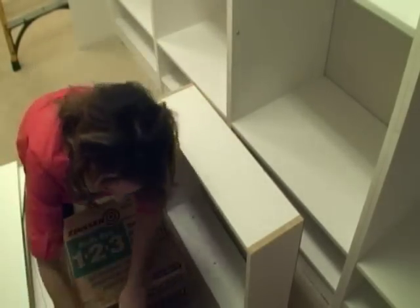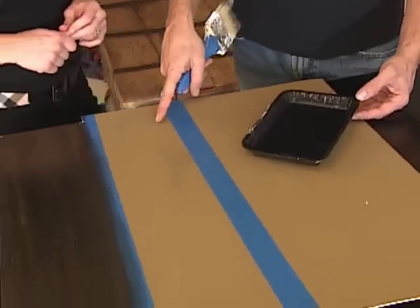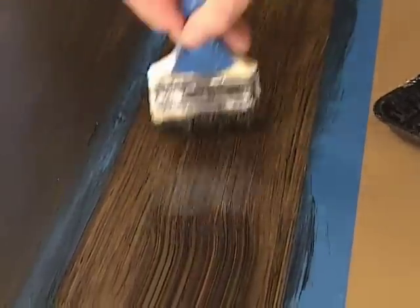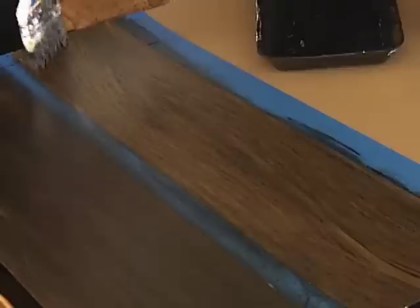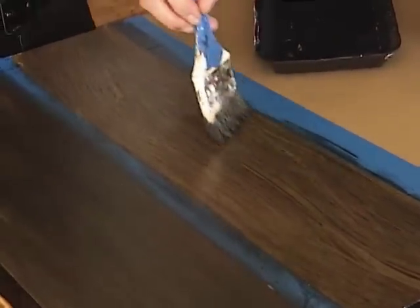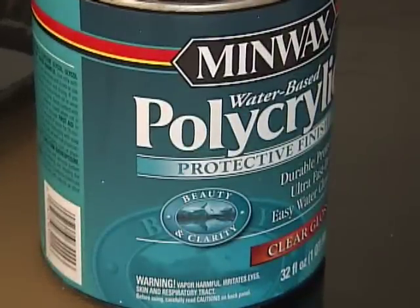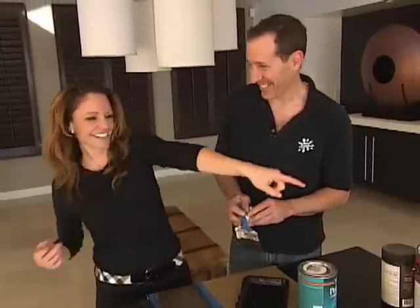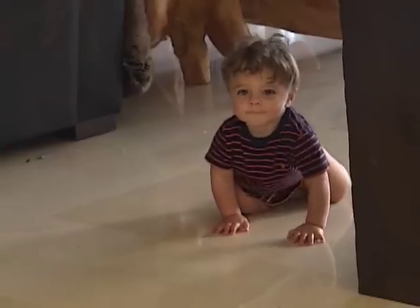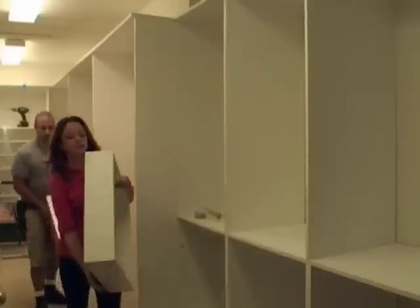Lots of paint! Which means I'll need a tutorial from Jeff. What we've done already is we've painted the lightest color of the wood — that's this base coat here. And what we have here is paint mixed with glaze. The reason we put glaze in it is so that you have a little bit more time to move it around. Just brush it on like this, and you're emulating the woodgrain. Once it has thoroughly dried, you want to put a coat or two of sealer on it, very, very thinly — let that dry, and put the next coat on. And with just a few weeks to finish the project, off to work we go.